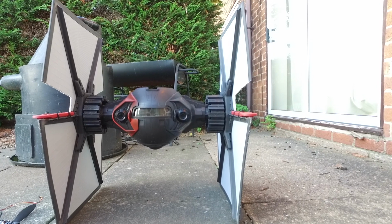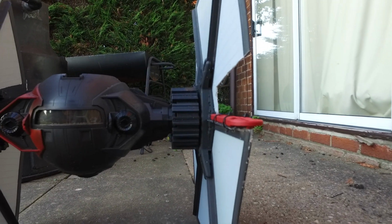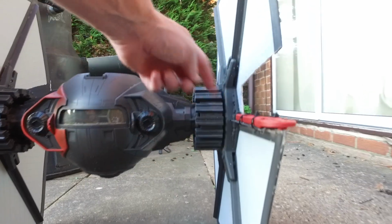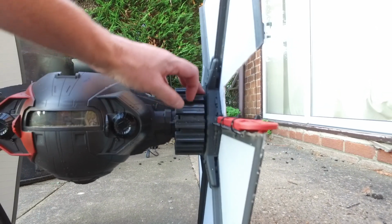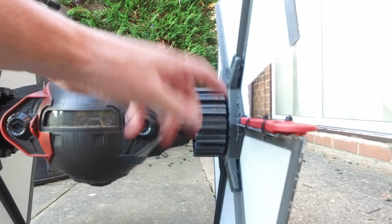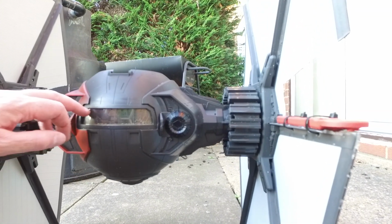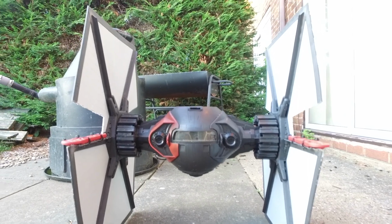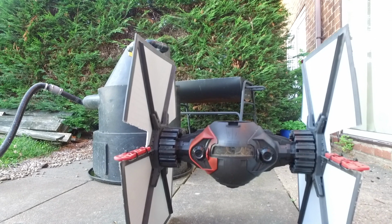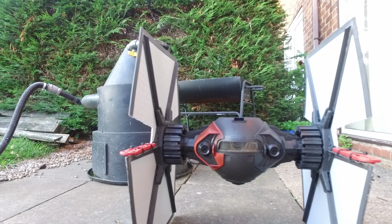So this is now last look update. So the arms are now glued in. It's just set in now. The cable tied. Really, I would recommend carbon rod all the way through, motor mounts on each end, the carbon rods. And that way it'd be a lot stronger structure. Before you put the winglets on, I would also recommend that you glue them in or you reinforce that area, because if you look at this, I don't know what that's going to do to the flight. That's going to make it a bit interesting. It's got a bit of a wobble, so that'd be interesting. Although once it's picked itself up, it might firm itself up, so we'll see. This is the back of it.